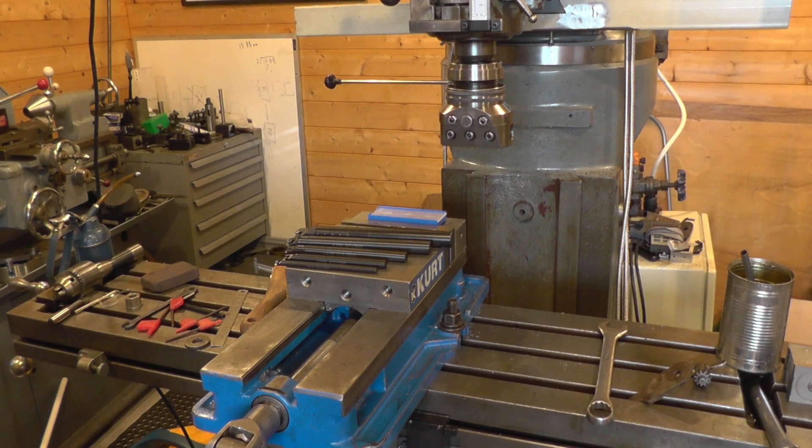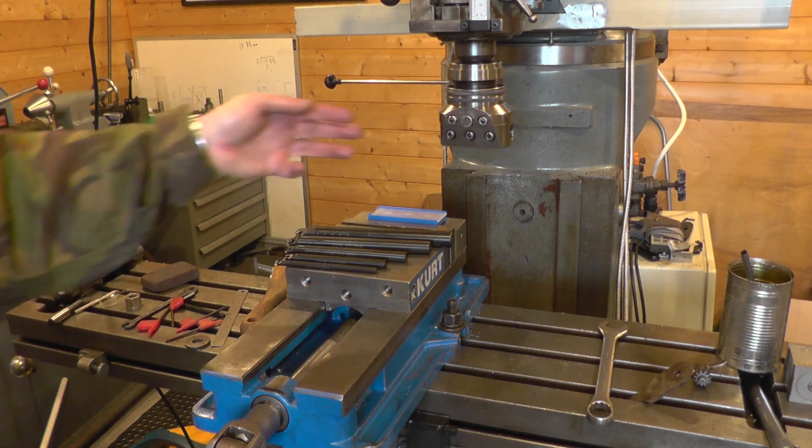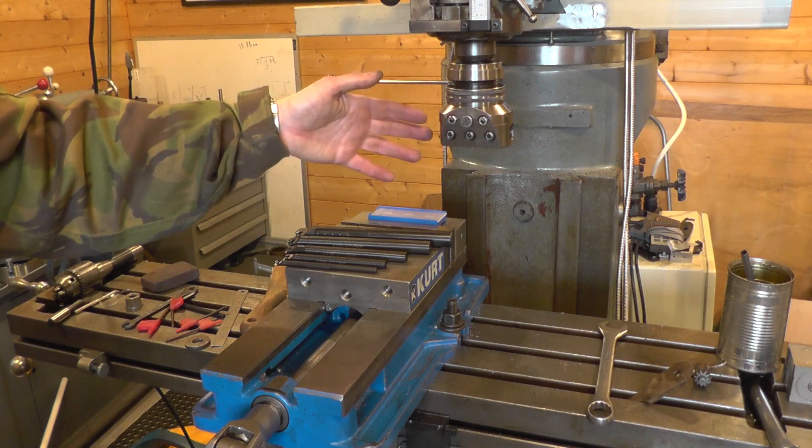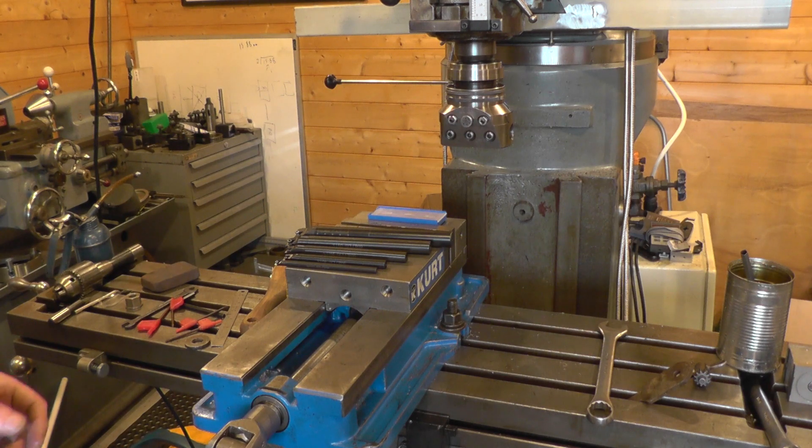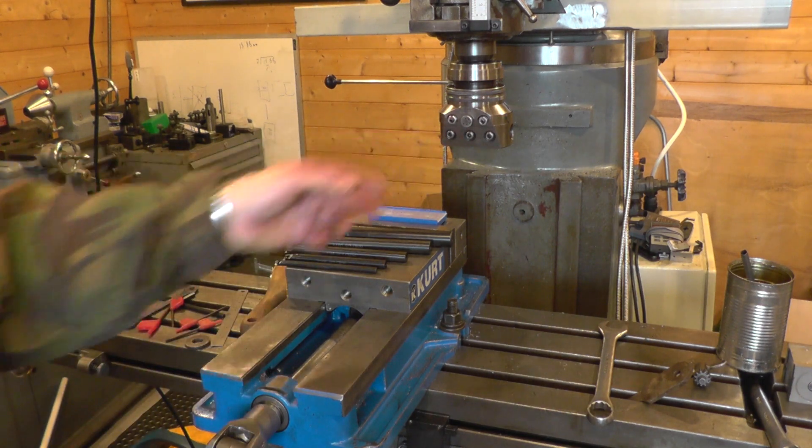I just wanted to talk briefly about this set of boring bars that I've just acquired. This automatic boring and facing head takes 19mm shank tooling and I don't have any boring bars of that size, and I don't have what I consider a particularly good set. So I thought what I would do is buy an inserted tip boring bar — they're easily available with a 20mm shank — and I'd shorten one and turn the end down to fit the boring head.